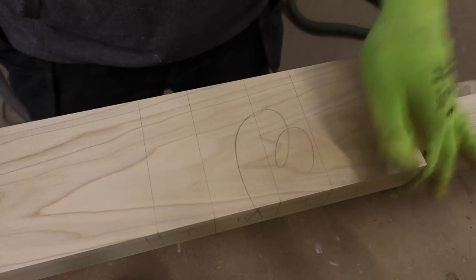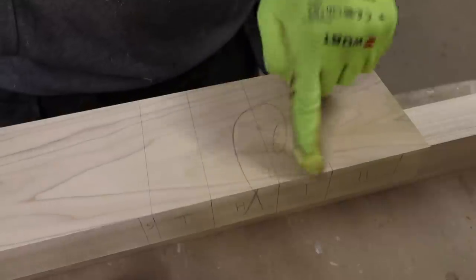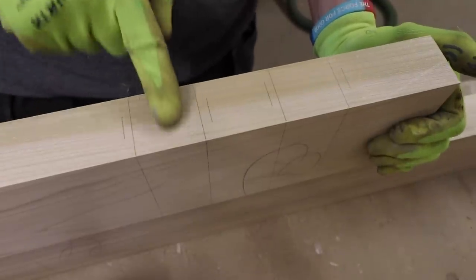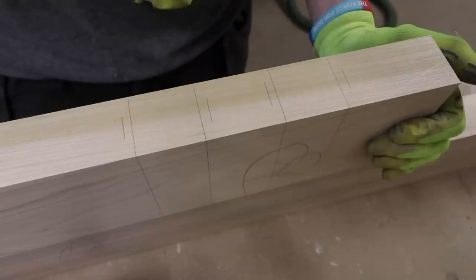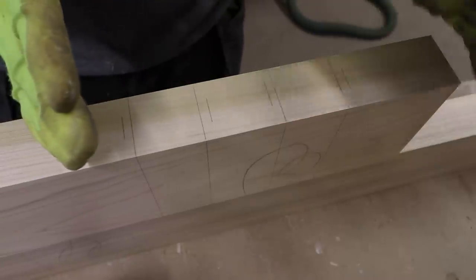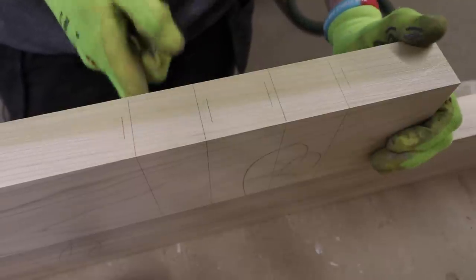And on the bottom rail, the detail should look like that. So tenons squared over the face of the piece of timber. And on the back edge, we've squared the tenons again, and then we've drawn a little wedge room on there as well. Wedge room, you can draw it on slightly narrower on the top side of the wedge, because that will be sat hard up against the stops in the mortise.